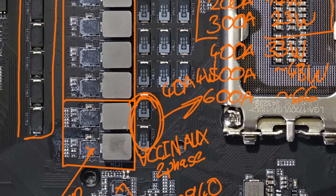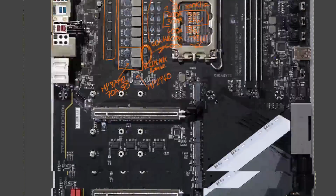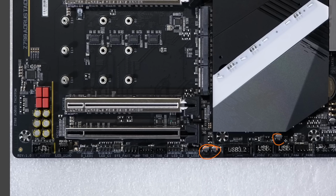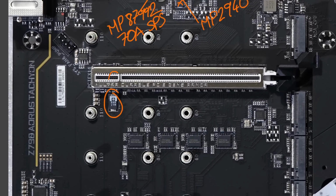Of course it has tantalum polymer capacitors for output filtering, because, look at all the, actually, well, nope, we have through-hole capacitors here and here and here, but we have a tantalum for, oh, this one's for the 3.3 volts.